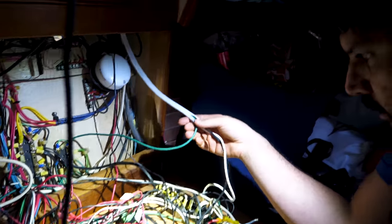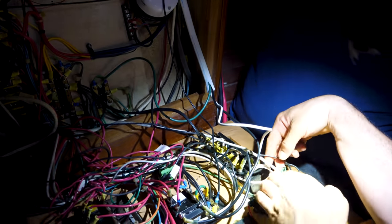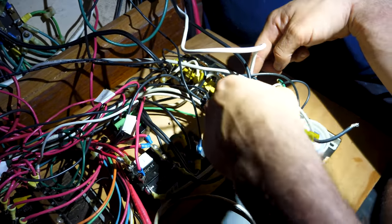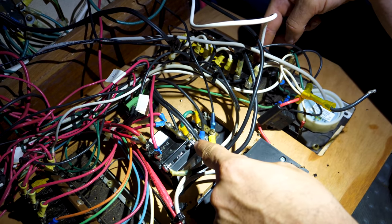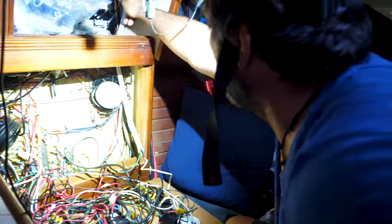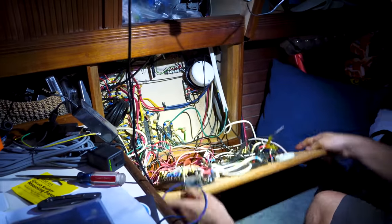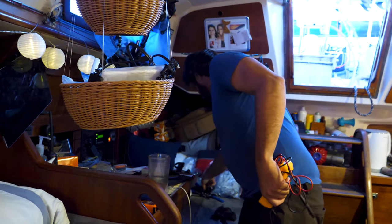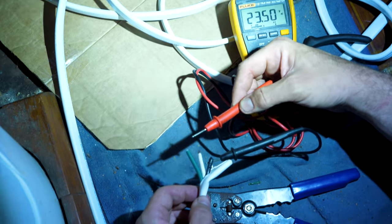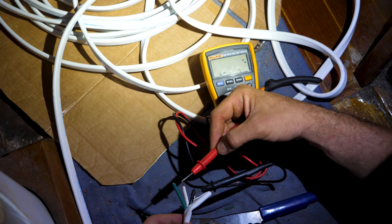So this is the wire for our air conditioner. The green — which is ground — is going to the green terminal. The white — which is neutral — is going to the white block. The hot is jumping from the hot main across to the circuit breaker, and then from the circuit breaker to the air conditioner. The switch will interrupt the circuit when off. The wires are run — the next step is to verify 120 volts at the leads. We read 122 volts AC confirmed — the wire is live.